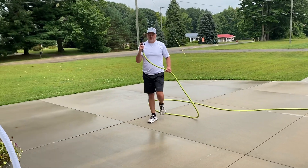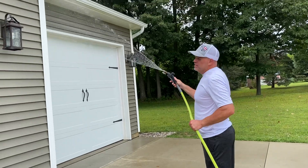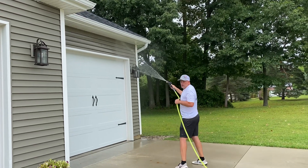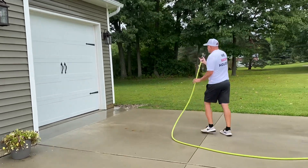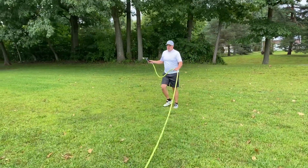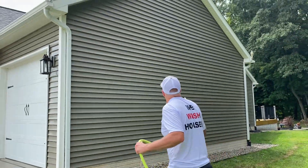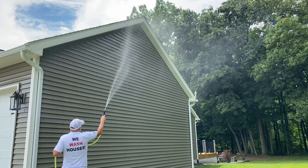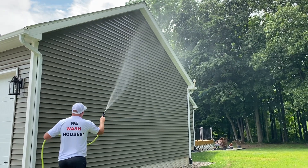So we're using the Sutner ST-510 with that North Star two-position J-rod. Here's the fan tip right now. The nice thing about this system is that it puts out so much water that you can rinse without needing a pressure washer anymore because of the gallon per minute we're putting out. It puts out some pretty good water. Come on over here and we're going to check the other side.